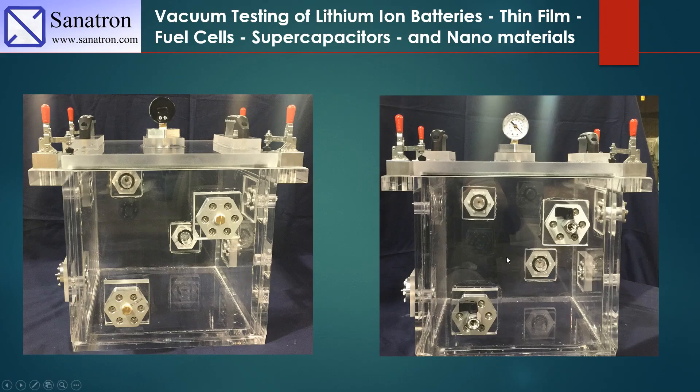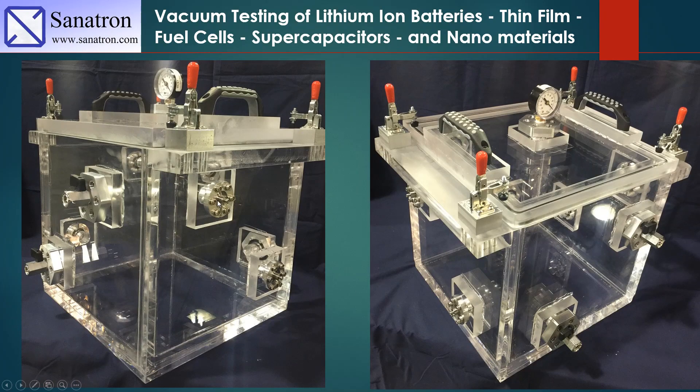What we came up with was a simple acrylic vacuum chamber with extra NPT ports. These are custom designed plates that fit with NW25, or KF25, or quick flange 25 fittings. This is essentially a converter that converts an NW25 acrylic port to a metallic quarter inch NPT. On this side we were looking at two quarter inch NPT valves, and on the other two walls we had those SMA coaxial fittings at 50 ohm impedance on this wall and the other wall as well.